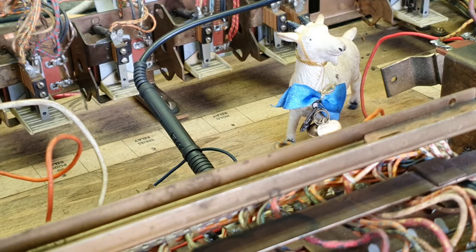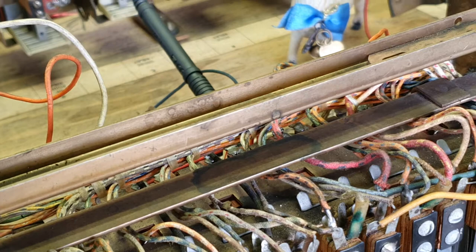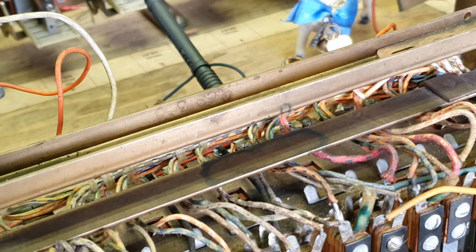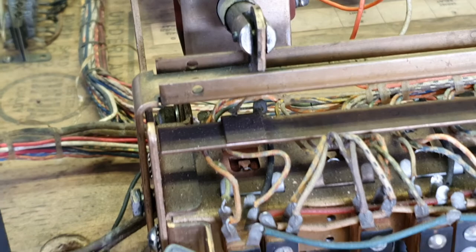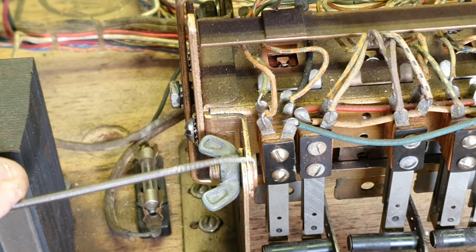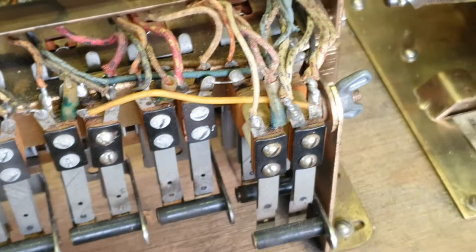It's a bit fiddly — you adjust it as best you can and you've got to keep this bar out of the road. This is the reset bar and remember it goes underneath, not on the top part. Put it back down, lock the wing nuts into place. As we've said in previous videos, make sure the outside frame and the inside frame are even — pushed down the same on both sides. It's very important, otherwise you'll have problems with the trip bank.